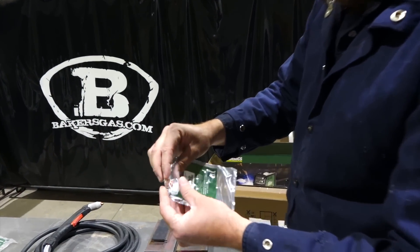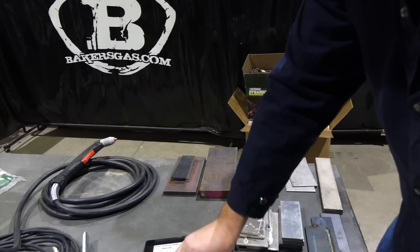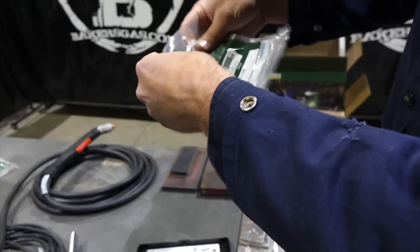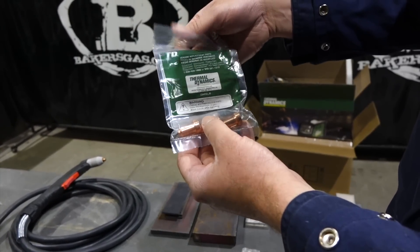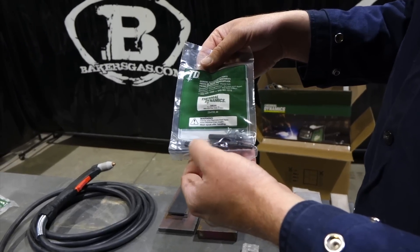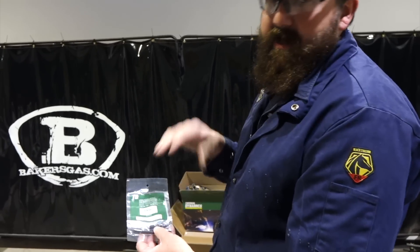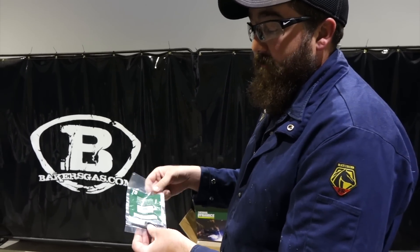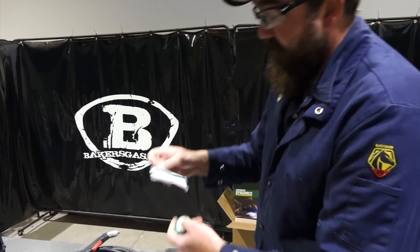Also in this kit, we have the shield cap for gouging. This thing comes with a set of gouging consumables, and also a gouging nozzle. It also has three 60-amp standoff replacement parts in the bag, and three drag nozzles in the kit. And it has three Black Series electrodes in the kit. These extend the life by 60% — it's anodized copper with more hafnium in the center, so it extends the life of the electrode. Pretty awesome. Comes standard in this kit. There's also a firing cap, some lube for the O-ring, and extra O-rings for your torch.